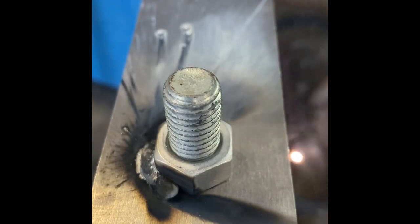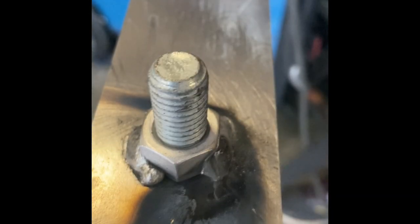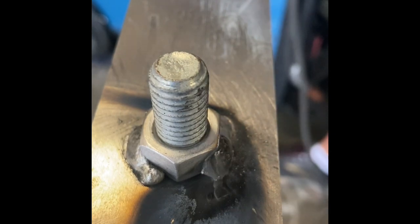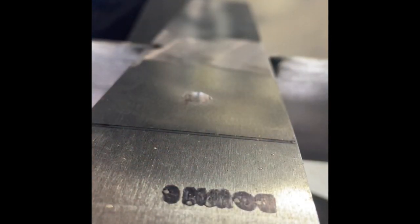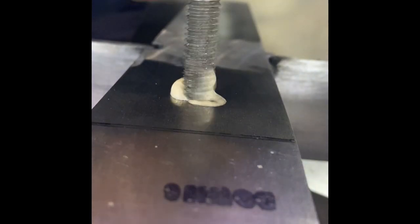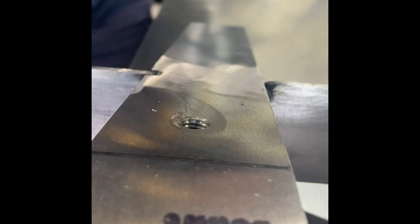This is the aluminum nut that goes underneath the base plate for the fuel tank. Just pay attention to how the gun is pointed down at the base material, just washing up a little bit of weld into that nut. I also put the bolt into there to act as a heat sink so that you don't wipe out the threads on that nut - just a couple spots, that's good enough. This is a technique a friend taught me on how to tap holes really easily using a little rattle gun. All I do is force a nylock onto the end of the tap and then use the rattle gun - the ratcheting system makes a really nice almost foolproof way of tapping holes without the threat of breaking one off.